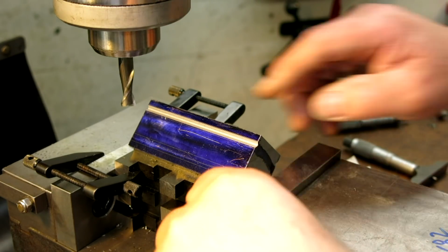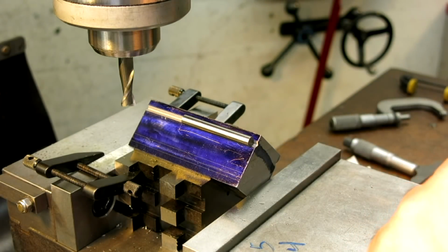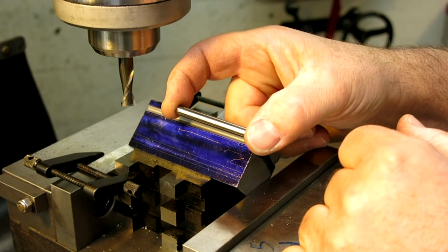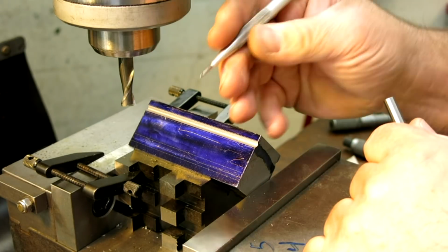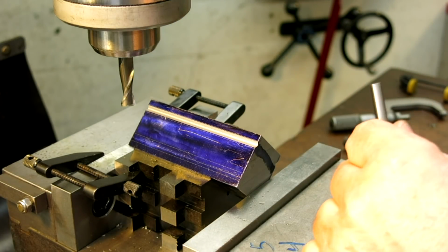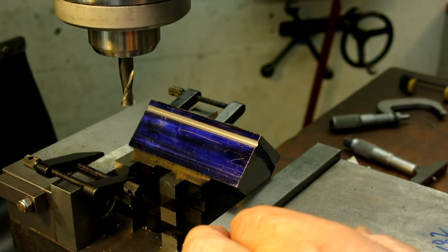So I was over there doing the math to figure out the position here, and I discovered something kind of interesting: for the size of this particular groove, the way it is right now, this pin is actually a little bit too big. It's sitting on the corners as opposed to the flats. It's not actually engaging the flats right now, which when you take measurements based on that, gives you erroneous numbers and messes with your game a little bit.